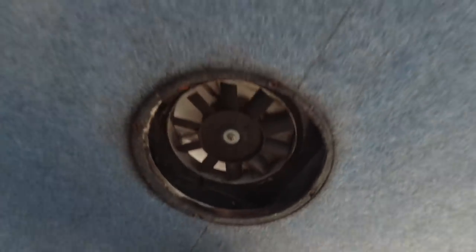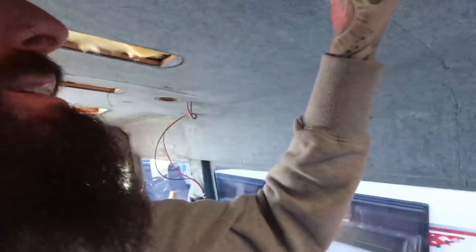Right, so this roof fan here is one of them that's got like a dome thing on top, but it is leaking, so it's getting sealed up. It's probably more trouble than it's worth removing it and then having a big hole and sealing that up. I've just tried taking the screws out as well, and they just rounded off, so the customer is cool with sealing the whole thing up from outside. But it's going to be covered with a solar panel anyway, so it ain't gonna matter too much. Everything else on the roof looks all right. I've taken out daft bolts that were here, sealed them from the roof as well. Just gonna send some links to solar panels to the customer so they can get that ordered.